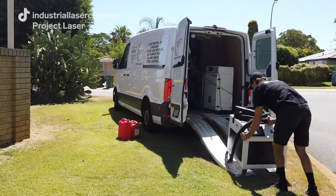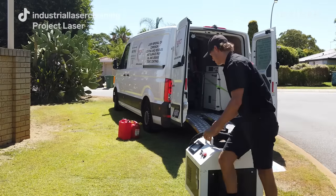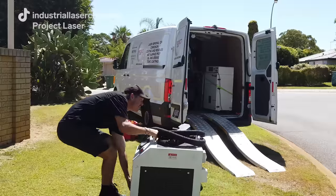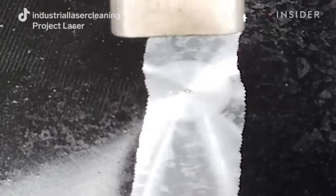The beautiful thing about using a laser cleaning machine is you can really adjust the parameters depending on what you're cleaning. If you want to clean a larger area quicker, you can have a beam that goes 100 millimeters wide — about three and a half inches. You could turn the power up and have a large beam for large areas, or really wind the power down if you wanted to remove soot off a chandelier, a bathtub, or the side of a TV — you could wind it down enough to not damage even plastics if necessary.